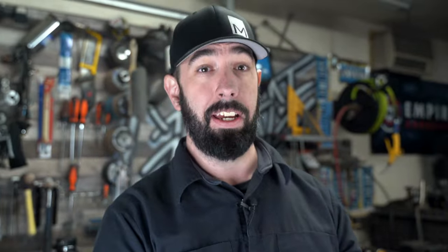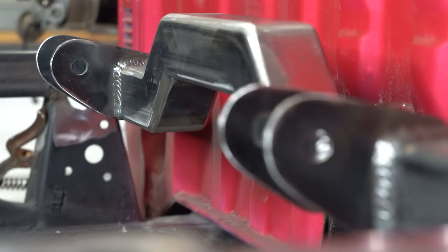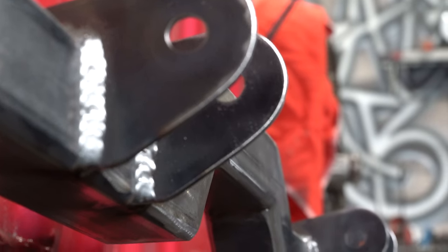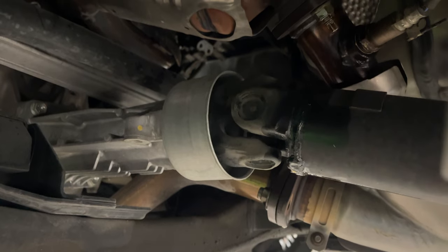Now that the rear axle position is marked, you can begin construction. I start with the front crossmember pushed as far forward as possible. The further forward the crossmember is, the longer your link bars will be. The longer your link bars are, the better match they will be to your driveshaft, requiring less movement of the driveshaft slip yoke. We'll talk more about that in a Suspension Basics video I'm working on called Third Links — hit the subscribe button and the notification bell for that one. With the crossmember in place and the link bar tabs attached, we can now make some rough measurements.